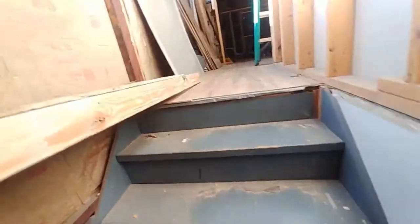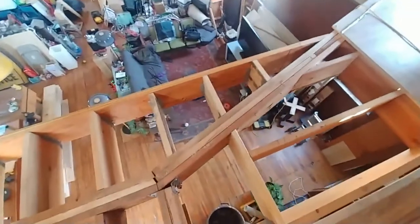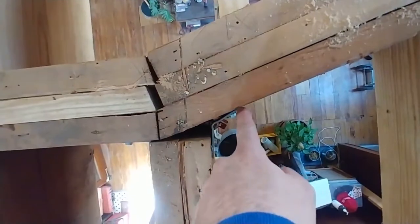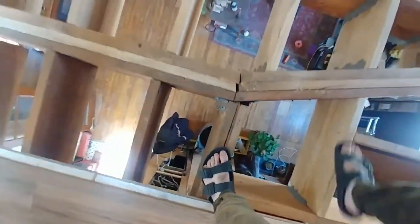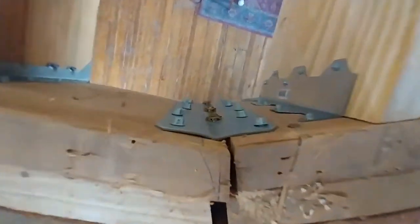So once they were all in with quarter by 1.5, Simpson hardware, which is what they're designed to be used with, then I took a real long lag replacement timber lock, what do you want to call it, construction screw. So we had the original 90, then we opened this one up a little bit. You can see on Instagram, I'm going to make a post where Brad had this big clamp thing that we could sandwich and smash them down. We also had to beat it with a hammer, and these ones here were even more flat, practically flat.